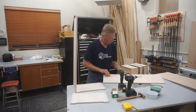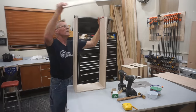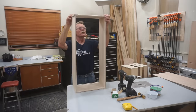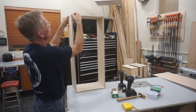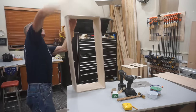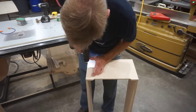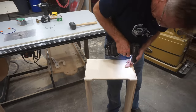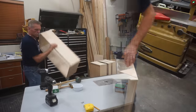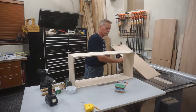There's a little sawdust in those joints. And I may have to do a little sanding to ease the pressure in there on the final assembly. Generally though, I'm real pleased when the joints are this snug at this stage. I can always loosen them up. Having the drawer stand on the floor like this really allows me to bear down with the drill driver and the joinery to get everything assembled tightly and in a hurry. And that's the last of the drawer boxes for assembly.